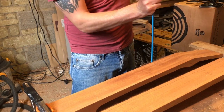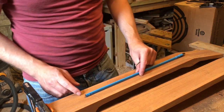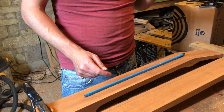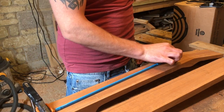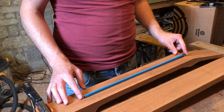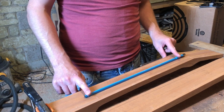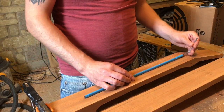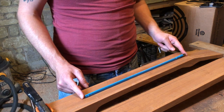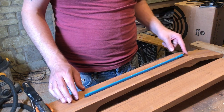I'm going to make my truss rod channel ever so slightly longer — about a millimetre — than my truss rod itself. The reason for that is when you recess a truss rod, you don't carry on routing all the way down, so you're effectively recessing the truss rod inside with wood all around it. If you make the truss rod cavity exactly the same length as the truss rod, it makes it harder to adjust. When you want to put relief in a neck, bowing it forward towards the strings, you're effectively unscrewing the truss rod and making it ever so slightly longer. So by making the channel about a millimetre longer, there's adjustment room and it won't hamper the truss rod in any way.